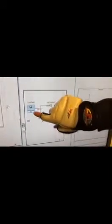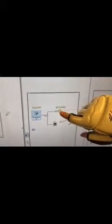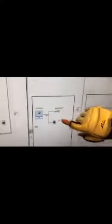The next part of the flat sequence is the force measurement. The user will be asked to punch the force plate, and then the output of the force sensor will be taken to a function which will get the maximum. If the maximum is above a certain threshold, indicating that the user has punched it, we end the loop and store it in the array.